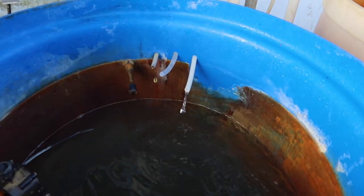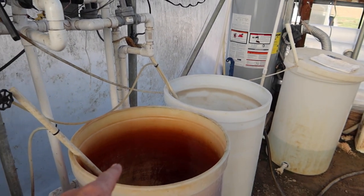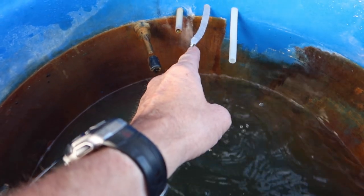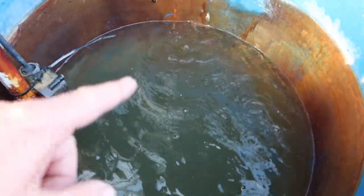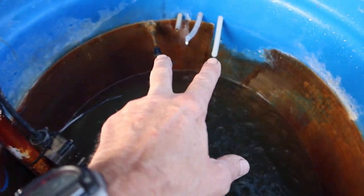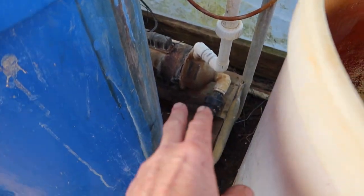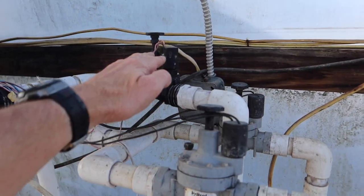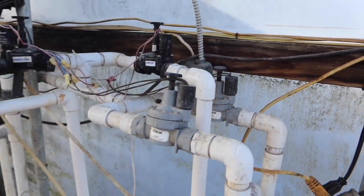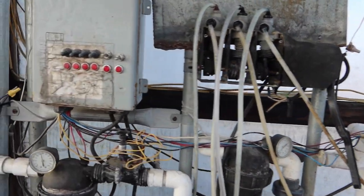You can see it running right now. This is a bellow pump proportioner — it's drawing fertilizer and nutrients out of each tank as well as the sulfuric acid tank. This is the sulfuric acid tank, this is tank number two (the clear one), and the orange one — orange from iron — we call tank number one. Fresh well water is being circulated and filled into the tank as the bellow pumps bring fertilizer in. It's all getting mixed up and is currently being pumped through this pump, goes through a filter system, and then there are four different solenoid valves — each one represents one greenhouse.